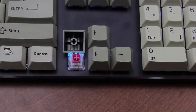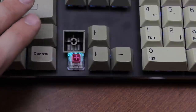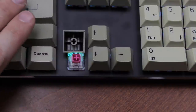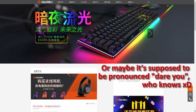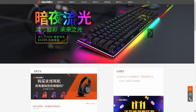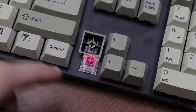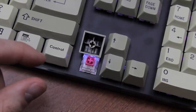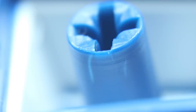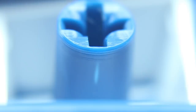Now, of course, there's one thing you're all wondering about: do they still crack keycaps? I've been relentlessly pestering Mike from Novelkeys with countless questions to get to the absolute bottom of this. Originally, the stems weren't designed to be as thick, but Kaihua's first major customer, Daru, asked for the x-axis of the stems to be made slightly thicker — 1.32mm instead of 1.30mm — so that they would fit more snugly. Kaihua complied and the switches entered the common market still with Daru's specs. However, it was found that in some cases — presumably where the switch stems were on the thicker side of the tolerances and the keycap ones on the narrower end — the switches would stretch and damage the stems and the keycaps. My own SA Dasher caps fell prey to this after being used on my Box Navy keyboard, and quite a few of the stems were damaged permanently.